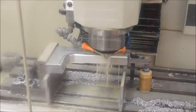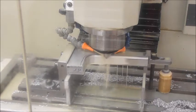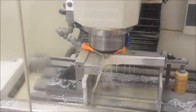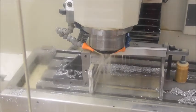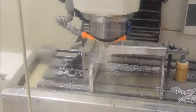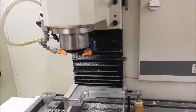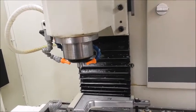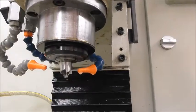Well, hello again, it's Cliff here from down under. TTS has its advantages as well. While it has the disadvantage of not being as rigid and secure as BT30, it has the advantage of being very versatile. It's based on the R8 system.